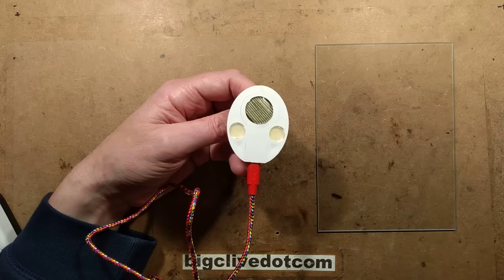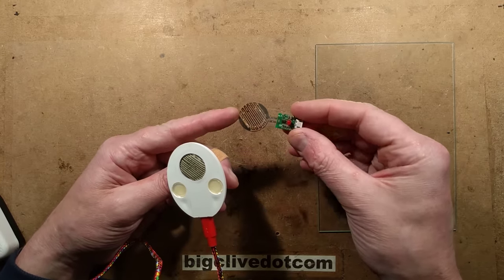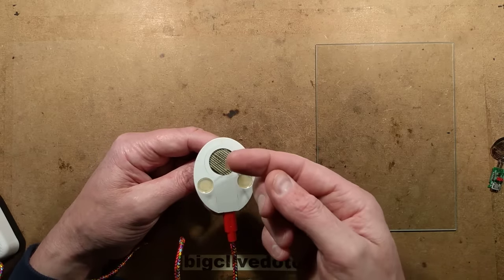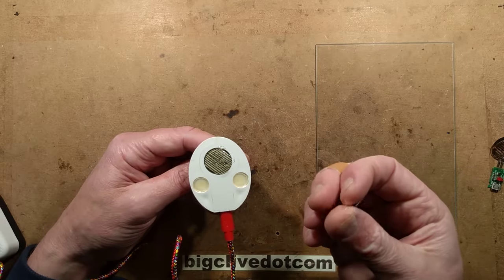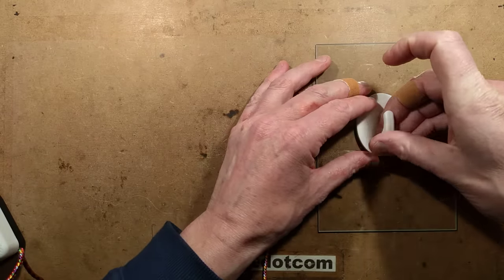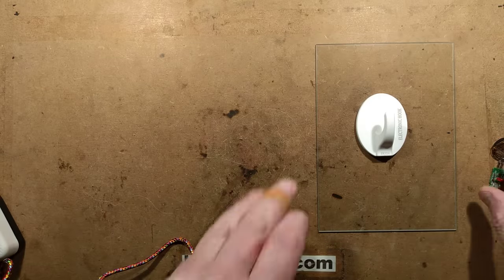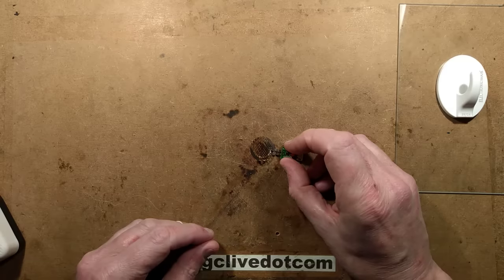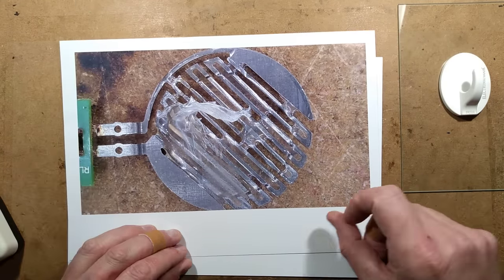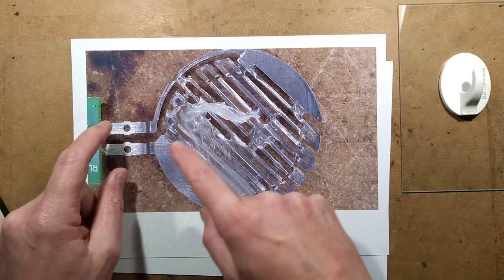While we wait for it to heat up, I've taken the other hook apart - I couldn't resist. Here is the heating element: it's a two-ohm heating element, and then there's active circuitry. I zeroed out the meter leads and measured from side to side - two ohms. There's also active circuitry in this, more about that in a moment.